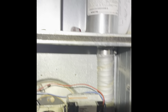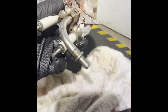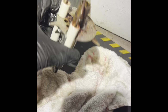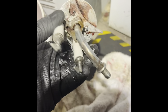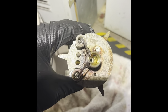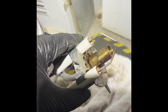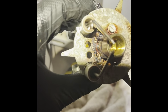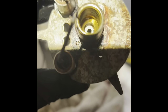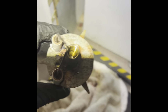The flue is obviously no good. So basically I take a wire brush to the nozzle line assembly and draw assembly — I don't go crazy with it, but I definitely give it a scrub down and squirt it with oil. But it's K1 — K1 stains. You're not going to get it perfect, don't waste all your time. Because it'll run perfectly fine even looking like that — that does not affect the operation, that's just staining. Unless you're plugging up those two holes with dust or lint — then the cad cell eye can't see the flame. So you want to make sure that's clear, and make sure you've cleaned out the inside of that, which is where the fuel comes through into the nozzle. Make sure that ain't got debris in it.